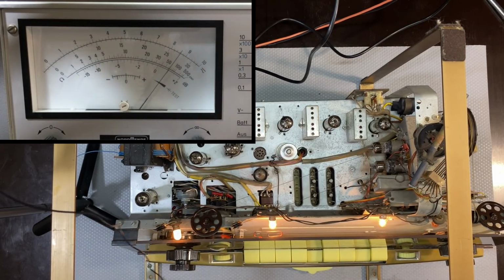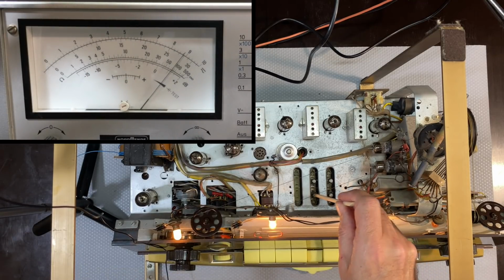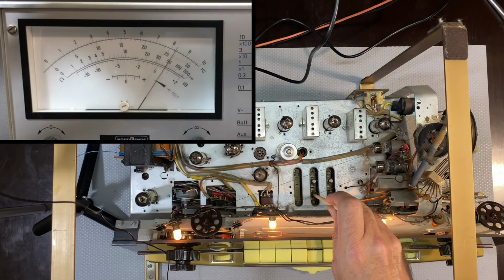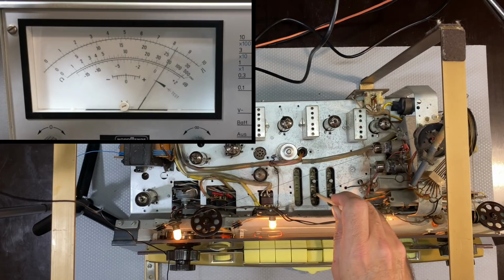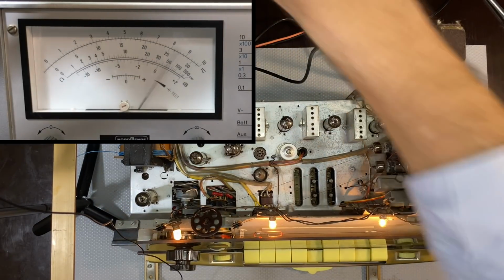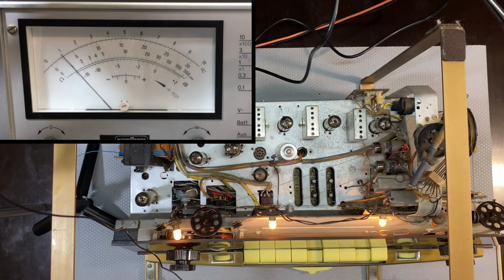I'm just going to check the antenna circuit because the oscillator is obviously maximum. 17 and 6. Okay, so the one I need to adjust, according to that, is this guy here. Nope. Yeah, that was spot on. Okay, let me go to, what is it, 570 again? Perfect. I can hear it.